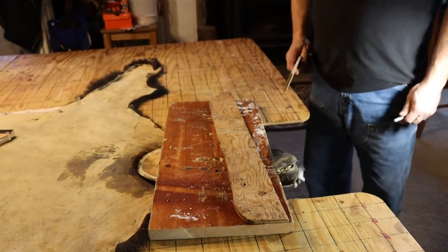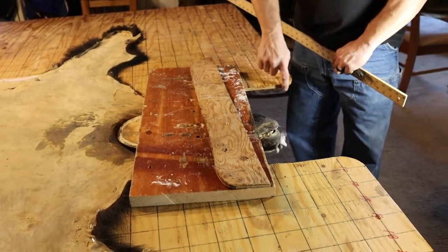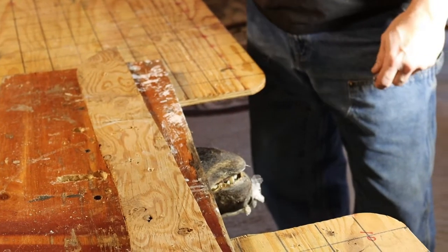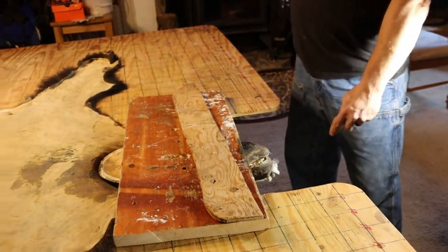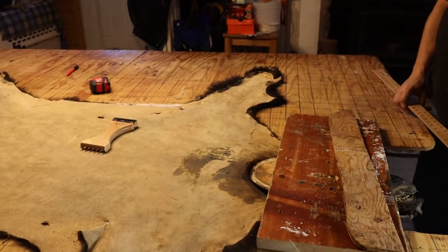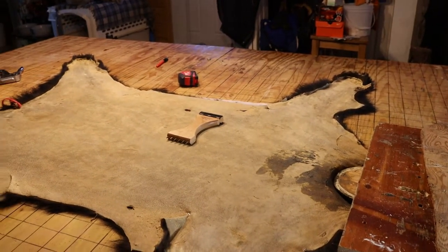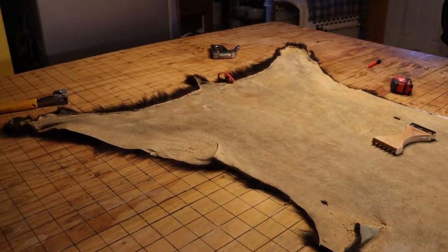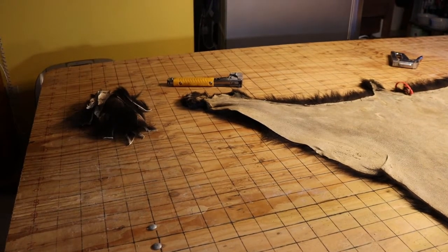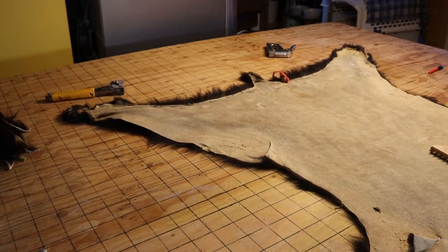Now, there again, when you're done with cutting this out, I highly recommend you take your jigsaw and you round the corners off on both sides. Any corner you have, here, there, the far one over there, any one you have, I highly recommend you round off, because the first time you catch it in the lower region, it will hurt, and you will do it. I've done it. That's why I round mine off now. That completes the table.